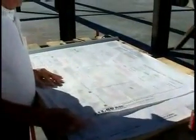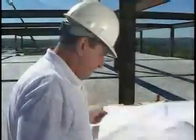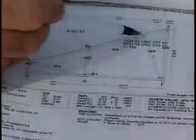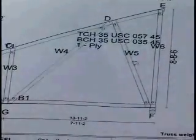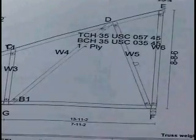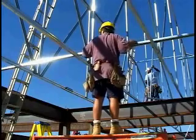As you review your individual truss drawings prior to installation, notice that certain web members have a symbol where hat channel is called out. This symbol indicates the need for a lateral brace to be attached to this web and similar webs in the adjacent trusses. This bracing resists buckling in high force or excessively long web members.